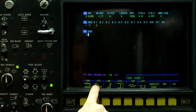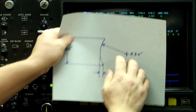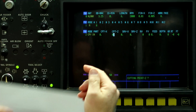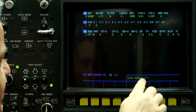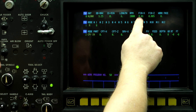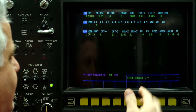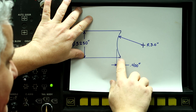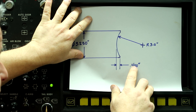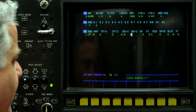So we're going to use the copy motion, on the inside. The cutting point on X is going to be zero from the center line. Cutting point on Z is the face of the part, which is also zero. Stock removal on X — we need to have the stock removal equal to or greater than the finish allowance, so I'm going to put in 10 thousandths. Stock removal on Z: from the face of the part down to the bottom of that radius we have 400 thousandths deep, so we're going to put in 400 thousandths.